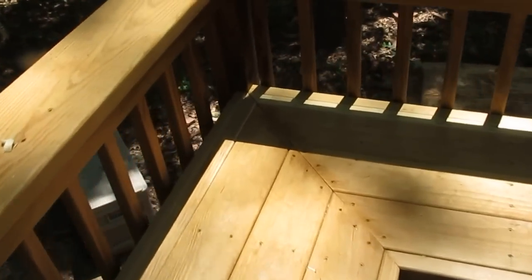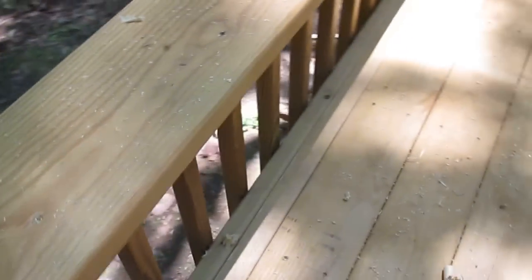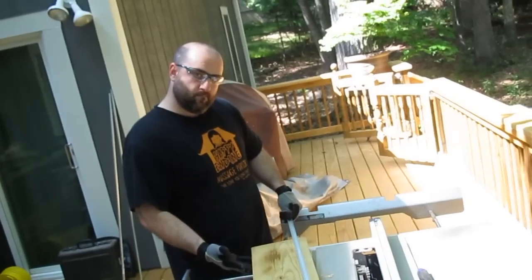One of the things I had to do was finish up my buddy Spitz's bench here. I had to scribe in these pieces because they're skinny in the middle and fat at the end. That was fun — made a lot of dust on that deck. The next step will be taking off these rails and putting a dado underneath for the aluminum extrusion that the LED strips will go on.